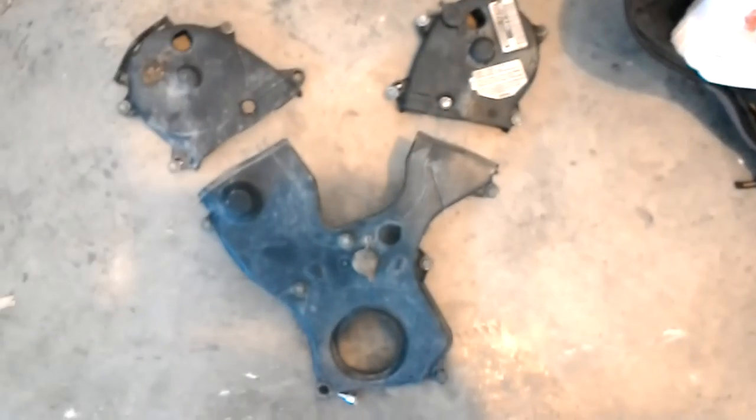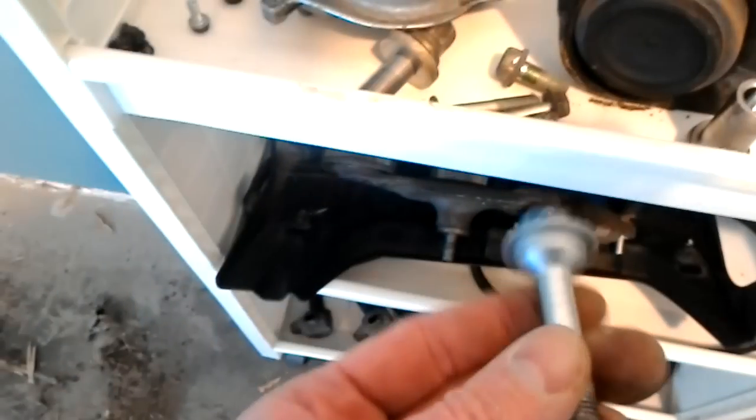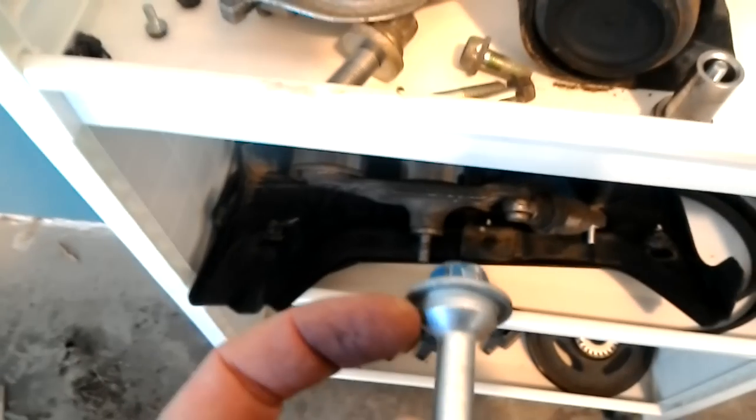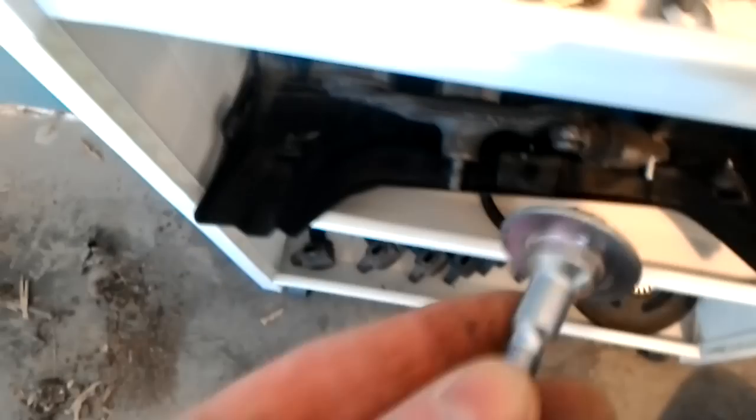The project is going just fine. Unless I have some major issue, I'll probably be done in a couple hours — putting this back together really doesn't take much. Here's that dreaded washer everybody talks about; just got to make sure it's out so it doesn't grab your belt. The condition of the belt I removed was okay — no signs of extra wear or tear, but I think it is stretched a little bit. The tensioner and idler pulley bolts have a cone on them so you can leave them loose, which gives you some slack, and as you tighten them up it centers the idler.